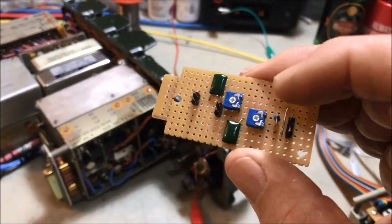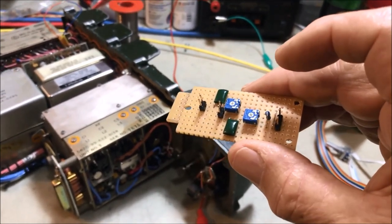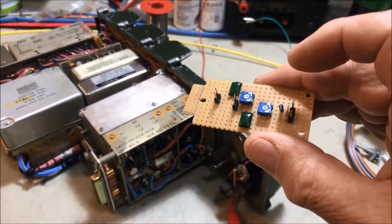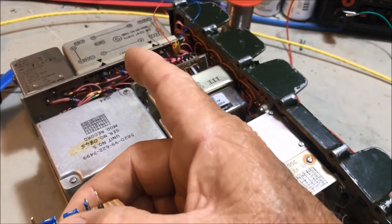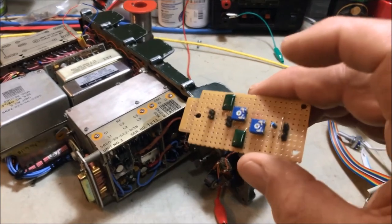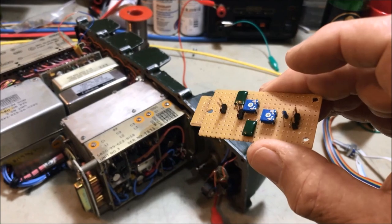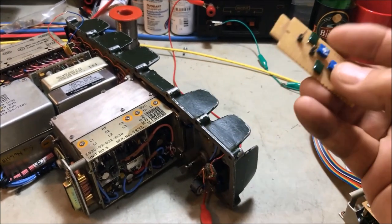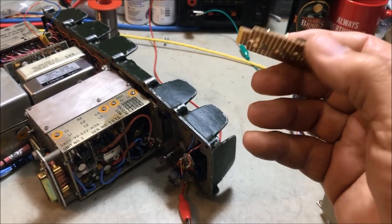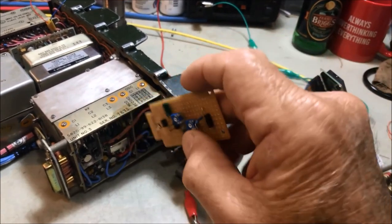And you see the little potentiometers that I've got on here? They're to set up the 300 millivolt peak-to-peak sinusoidal wave that I'm going to need for both places. It will come out of the new synthesizer as a bigger amplitude wave than what's required. So here is going to be the separation and the attenuation down to the right wave. A little bit of DC isolation as well with these 10 nanofarad capacitors will make these both supplies independent. So that's going to be mounted in here.